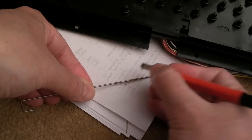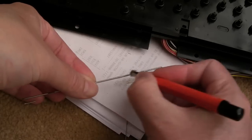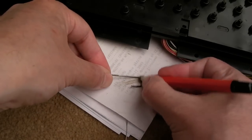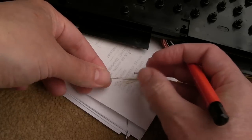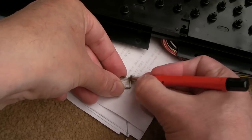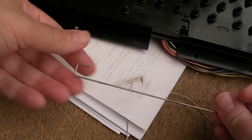So let's get that little bit of corrosion off there, and I'll just wipe over that with a bit of WD-40. You could just use 3-in-1 oil or something when you're wiping something like that, just to help it stop corroding again. Generally, those things won't stop rust entirely. It will just come back unless you replace it with something, ultimately. Or cover it in a thick grease or an oil.